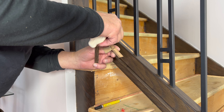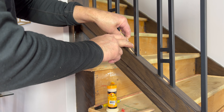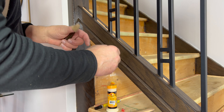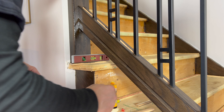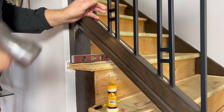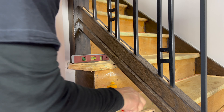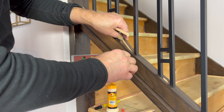You'll see here that I get into a bit of a wrestling match with these fillets popping up. That's because I normally use a 1-inch 23-gauge pin to hold the fillets in place, but I wanted to see if I could do this process with just wood glue and avoid having visible fasteners — and it seemed to work fine in the end.